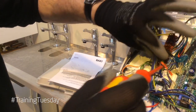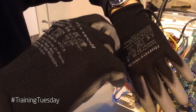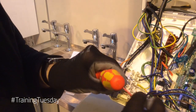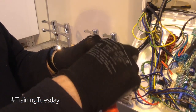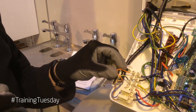Check the wire connections are tight and the green wires are connected to the green wires. Take the blue wire from the relay board and connect to the neutral on the boiler input terminal block, ensuring the connection is tight. Now take the red wire from the relay board and place it into the spur terminal by the side of the neutral connection. Tighten and ensure that the connection is tight. We now take our switch live connection from our controls — call for heat — which is typically on a Y plan or an S plan the orange wire. Take this wire and connect to the switch live input on the main terminal block as shown here.